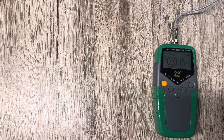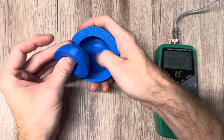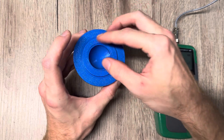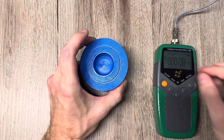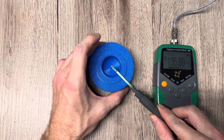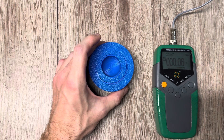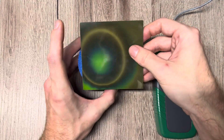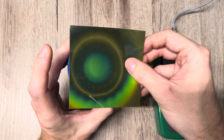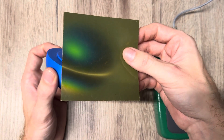Next I will take these two arrays and put them together. Since all of the poles are facing the same direction they are attracted to each other — with the blue arrays all north poles are facing inwards. Now that I've combined these two, the field strength will drastically increase especially at the center point. As you can see we are already at 137 milli tesla at the center point. Just to give you an idea of what the field looks like now under the magnetic viewing film — if I go right on top of the array you can see a slight change in how it looks.